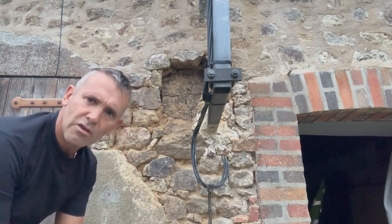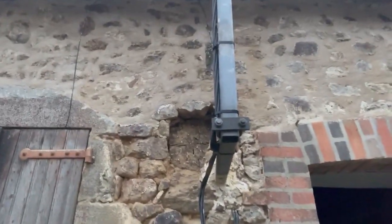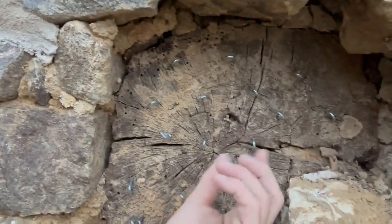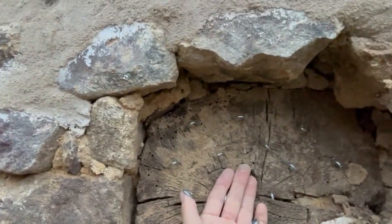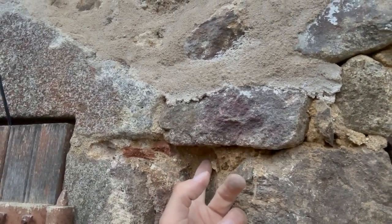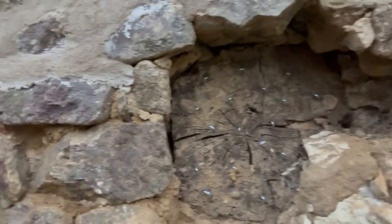Right, last one and I think that'll do — I'll show you what I've done. Little tricks of the trade, things you might not have thought about. So if you're looking at that now you can see what I've done — these are pretty rigid. These U-shaped nails are quite good. Hopefully the mortar will wrap around those and adhere to something, whereas normally when pointing, the mortar adheres to the material behind it and to the existing stones. All good — good to go.